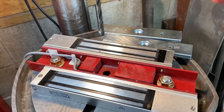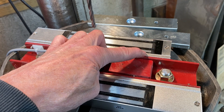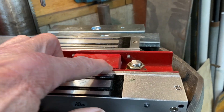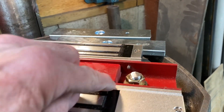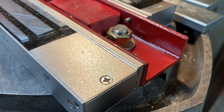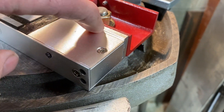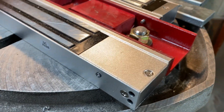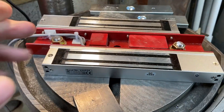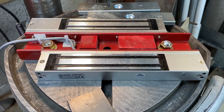Then I got a piece of channel. Basically what you do is you unscrew the magnet here from the channel and then you mount the channel — this aluminum piece here — you mount that to your whatever piece of metal you're using. Then you screw the magnet back onto this mounting strut here. I made it so that the magnets basically lined up so it would have good holding power.